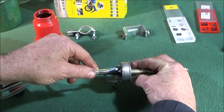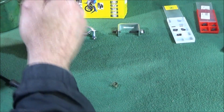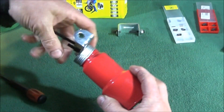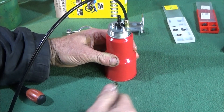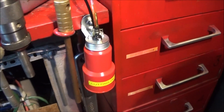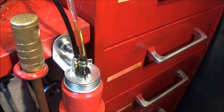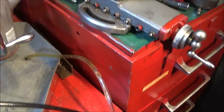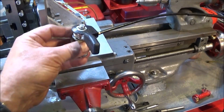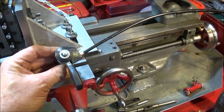There's the clip for the actual tubing which will push onto the nozzle at the top, but I'm not using this one — I'm going to use the tubing I've already got on my lathe. Screw that one on like that. You could put it on the bench or the side of the bench so it's easy to get at but out of the way. To mount the oil canister I just tapped the side of the wood here with 8mm and put an 8mm threaded stud in there, locked that on with a nut. I've put my sticker on and it's ready to go — plumbed into my original system.